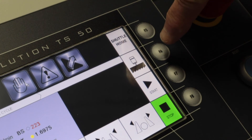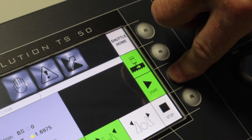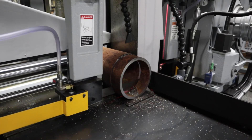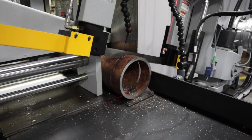Press F6 to enable the blade and then press F7 to start the blade and cycle. The blade will start and the head will descend with the set feed rate. After completion of the cut, the blade will turn off and the head will move up until the upper limit switch is activated.